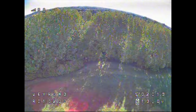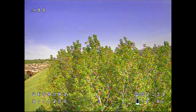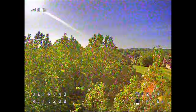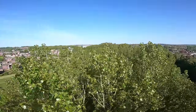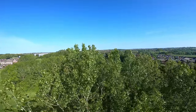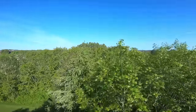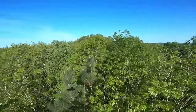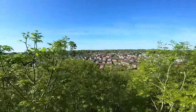Again 13 volts and it's flashing, and we're going to have a little trip around the trees. On this flight I actually made it and it didn't crash. The only thing that concerns me with this aircraft really is the little bit of jello, which I could put up with I suppose. We don't usually get sunny days like this, although we've had quite a lot of them this year ironically. And the other thing that I'm concerned about is that exposed foam. You can buy the frame as a kit, but I couldn't find anywhere where you can just buy the foam. I imagine if you had a bad enough crash and the props got caught up in that foam it would need replacing. All of the other Cinewhoops like this usually have the 3D printed internals of the protectors separate and you can buy them separately if they break, but I couldn't find any spare parts for those either, so you would have to buy the kit — that is a downside for me.